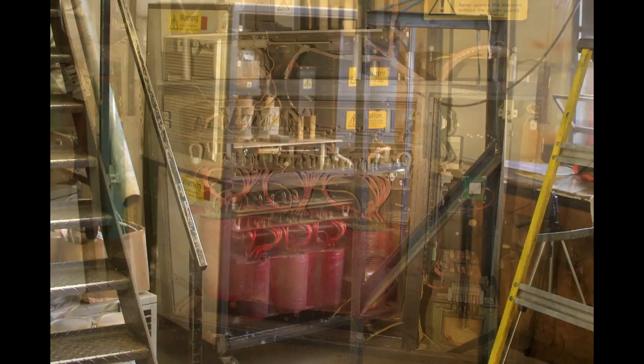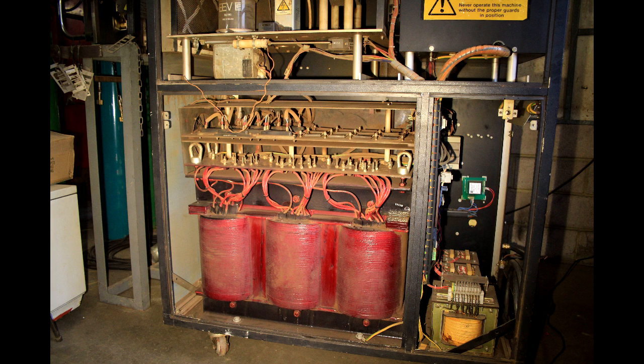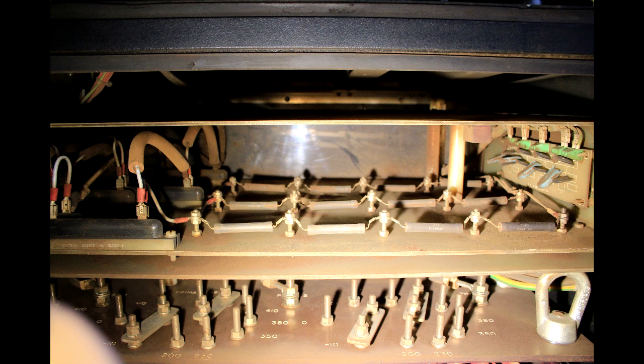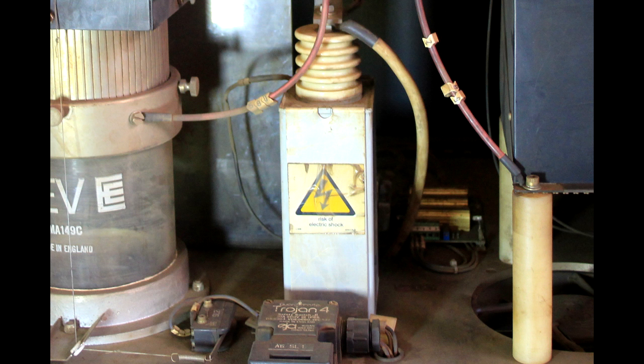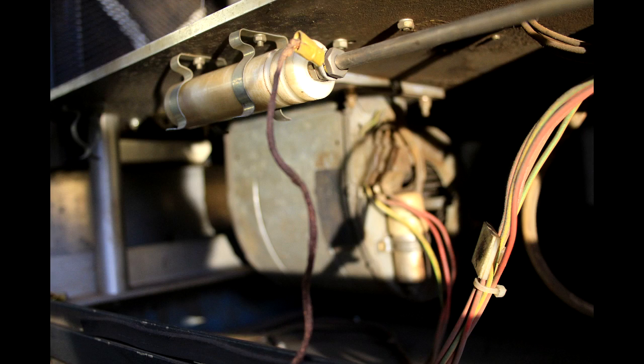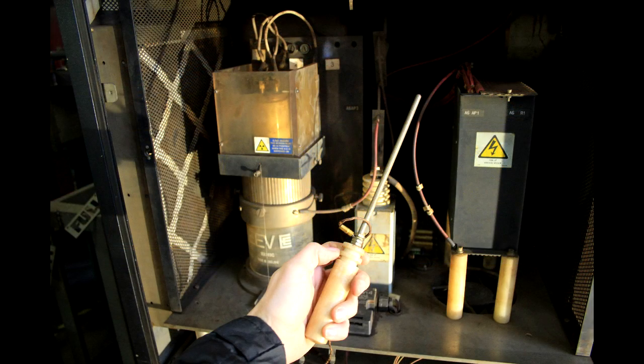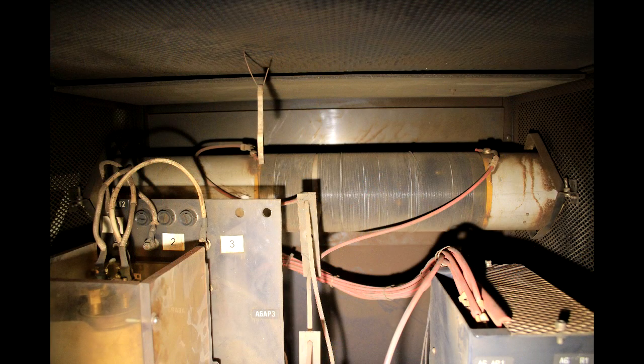This is the power supply and control rack, dominated at the bottom by a huge three-phase transformer running off a three-phase 415V 63A supply, producing 28,000 volts at about 1 amp — around 28 kilowatts to run the laser. Above the transformer are rectifiers and voltage dividers, which appear to be for voltage sensing feeding into a low-voltage board, with some large MOV surge suppressors. This then goes up to a capacitor rated at 30nF at 40kV. Helpfully, a discharge probe is provided to make sure it's discharged before touching anything near it.